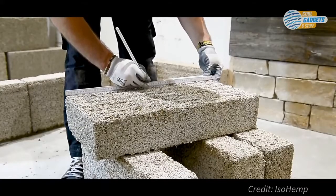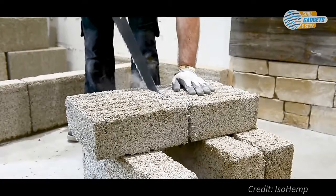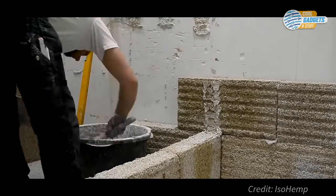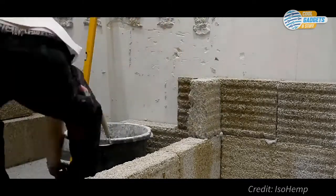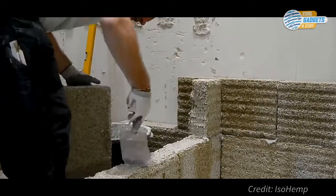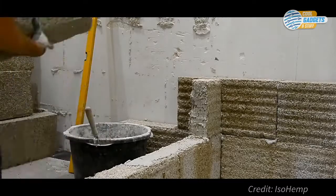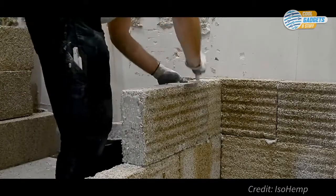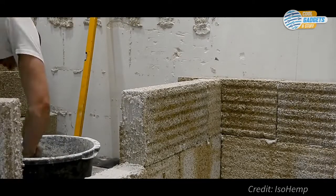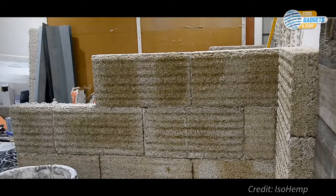Another form is precast hempcrete panels or blocks. A disadvantage of this form is that they require glue or mortar, which creates thermal bridges between the blocks, and the glue or mortar is commonly not a bio-based material, which impedes on the environmental nature of the material. However, a sustainable material such as clay could alternatively be used as a mortar. An advantage of this method is that the hempcrete is set before it is brought on site, which makes the construction process more efficient, but more labour is needed off-site to produce the blocks.